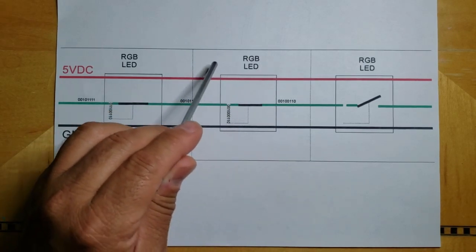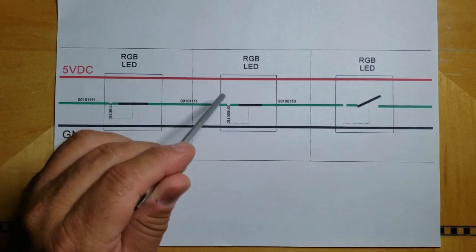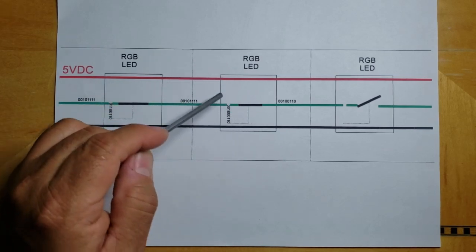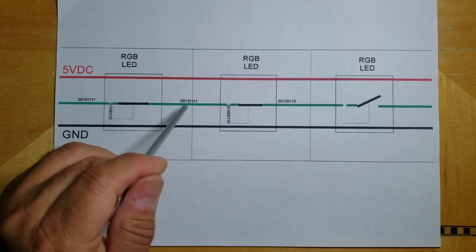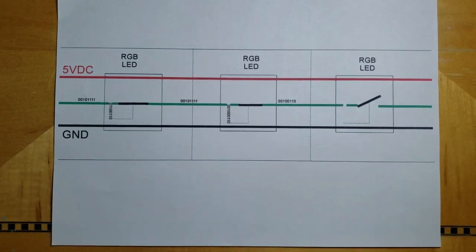Also, this will demonstrate how, if one of these LEDs, like say this LED in the middle, got destroyed because you overvolted it or you put reverse polarity on the LED, I mean, you essentially break this door. It just kind of explodes internally, and now you have a crater here where data cannot pass over to the next LED.